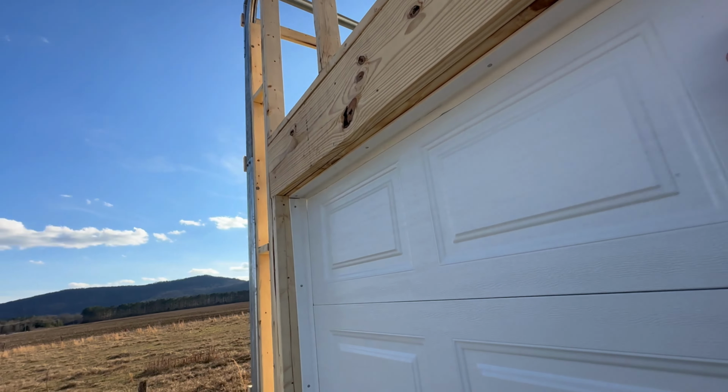you didn't see my 2x4 trick worked. It was the right height. The door was level. I put a screw in each hinge, took it out from under it, threw a level on it. It was good. Swung it a couple times. Went ahead, threw screws in the rest of them. And then I was like, hey, this thing wasn't latching. It wasn't close.